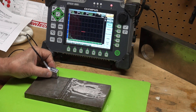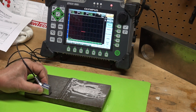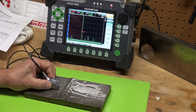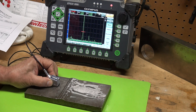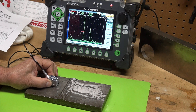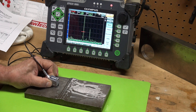Looking at this — here's a clean section of weld over here, nothing much going on while scanning. Then boom — look at that exploding signal right there. Very high amplitude signal. It plots right to the thickness of our plate, right at the ID. Very sharp signal, very strong reflector, drops off very rapidly. It's the machine surface we're looking at.